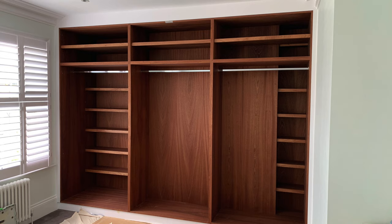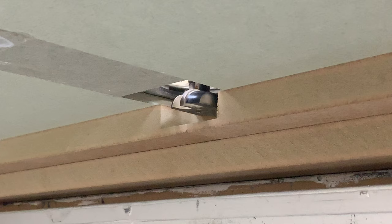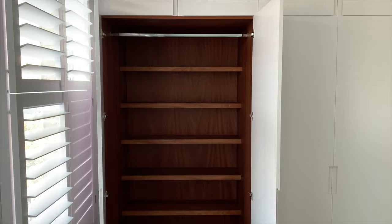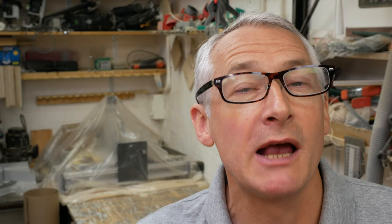Then fitting the hanging rails — cutting them to size and fitting all the brackets. Finally it's onto the doors. You might remember I made these before the wardrobes as they had to be sent out for spraying, so this is literally the first time they've been offered up. Starting at the center top I hang the first pair of the dozen doors I have to fit, then work my way around until they're all complete. With a grid of doors like this the shut lines need to be very tight and consistent, and the concealed euro-style hinges make this almost a pleasure to do — watch out for a concealed hinge video out soon.